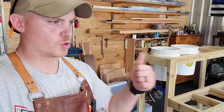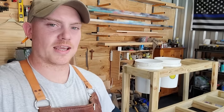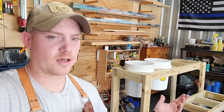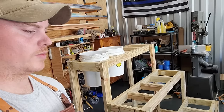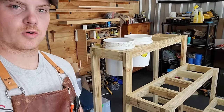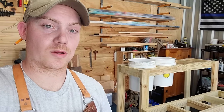That's a wrap on this one. Twelve eight-foot two by fours, a miter saw, a drill or impact driver, a speed square, and two one-pound boxes of two-and-a-half inch screws. You could use regular pine and paint or stain and seal it, but pressure treated is going to last a long time. I'll make a cut list PDF available on my website for free — link in the description. You could even sell these at your local market. Thank you guys for watching — if you're not subscribed already, I'd appreciate it, and if this was helpful give me a thumbs up. I'll catch you on the next video.